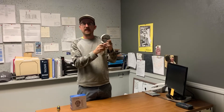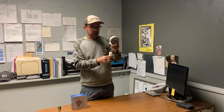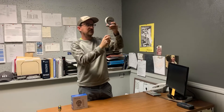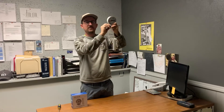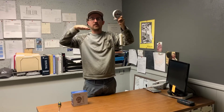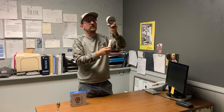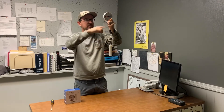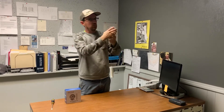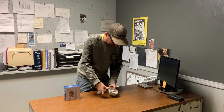When you are setting up this gauge you'll need to calibrate it, and the way to do that is you will measure the mounting point on top of the tank — the distance from the mounting point to the maximum fill level on the tank, which is going to be your overflow level. Usually on an underground cistern that's two feet. So we would measure down two feet, or whatever that max fill level is, and at that point we would take the faceplate off with a flathead screwdriver — there are a couple of indentations.